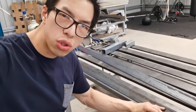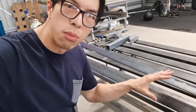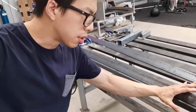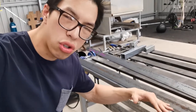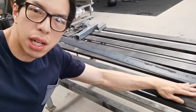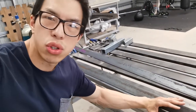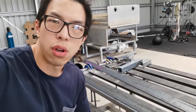the sheet metal gets sandwiched between the die and the straight edge, so the sheet metal is not moving anywhere. And the third piece is the piece that actually folds up with a hinge, so the sheet metal will be folded up together with that piece. It could be as simple as, I've got some stuff and a couple of clamps. Just clamp down the die, sandwich the sheet metal between the straight edge and the die, and find some way to bend it. If you're only going to bend one piece of sheet metal, that will be the way to do so.